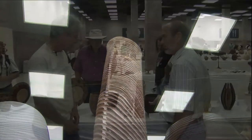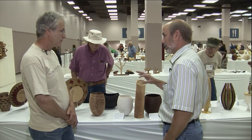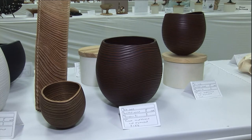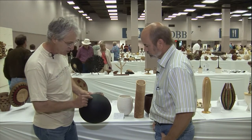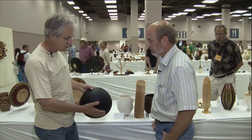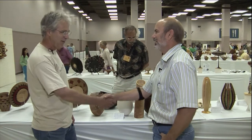That's a very advanced technique. How many hours do you think you have just in that piece? About 45 hours. For viewers at home, something simpler might be surface blasting with some color added. Here's a piece of cedar where I've blasted it just to raise the ridge lines — these ridges will pop up in most woods. In this case the whole piece has been made black, which makes the surface difference really stand out. This is a treatment you can do with almost any wood; some woods are better because the hard line is more defined. Thank you so much for sharing your insight.